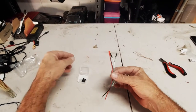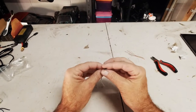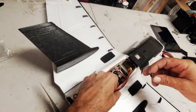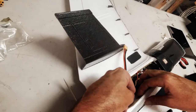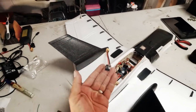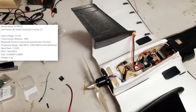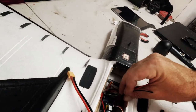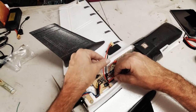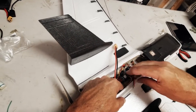This is what I'm going to use. I'm going to use this JST here for my power and ground, and these two plugs for my signal wires - receiver and transmit. They're already on solid, never been used. The module weighs 0.4 of a gram according to the spec sheet - I'll put a link up so you can have a look. I think I might just put it on the side here.